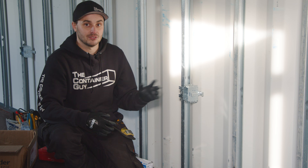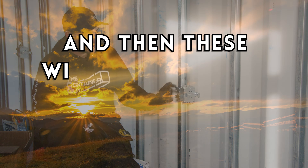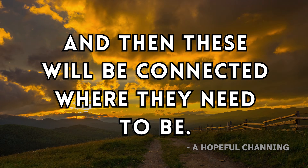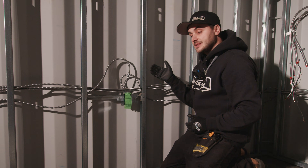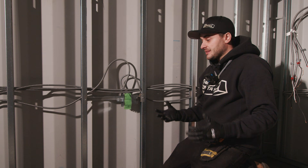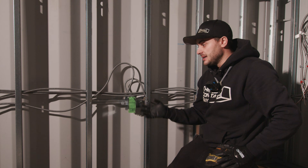So they're actually going to have to remove all of these. We're going to run the spreader bars and then these will be connected where they need to be. I noticed that the electricians were installing all the boxes right up against inside corrugations, but their method of fixing it was using a spreader bar that goes from stud to stud, mounting it to the back of them.